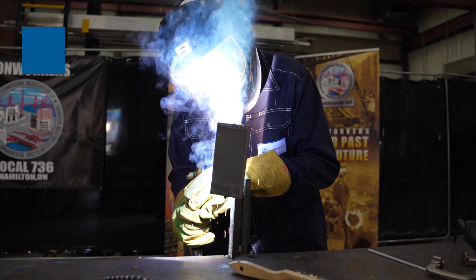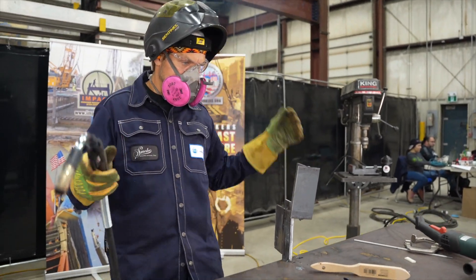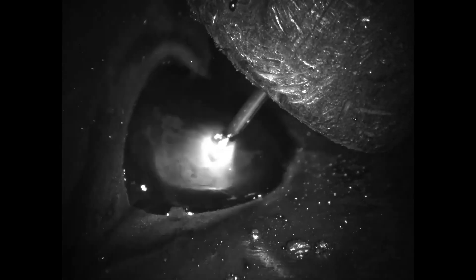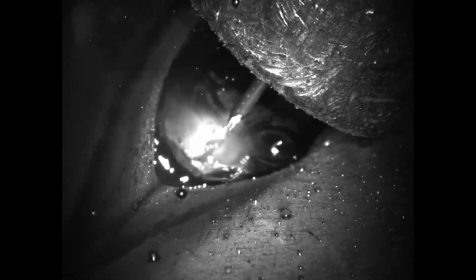The next cause we want to talk about is voltage. This can have a direct effect on that weld and whether or not you have worm tracks. If a welder decides to turn that setting up above the recommended settings, it can actually cause worm tracks. Looking at the SMAW process — when we increase arc length, that flux doesn't have time to get completely dissolved or melted off into the weld pool, which can cause porosity and other weld faults. Whenever we increase our voltage in wire feed, we're essentially increasing our arc length, so that wire doesn't have enough time to melt off and dissolve all the leftover gases, essentially trapping it in the weld metal and causing worm tracks.